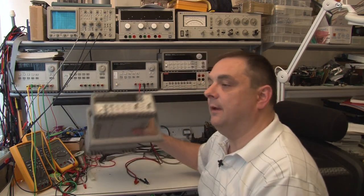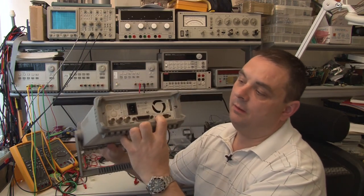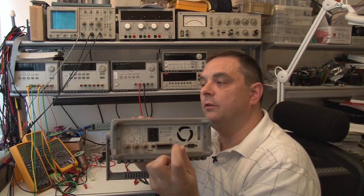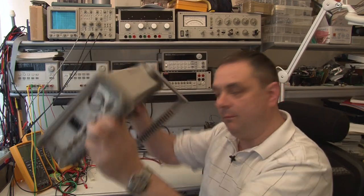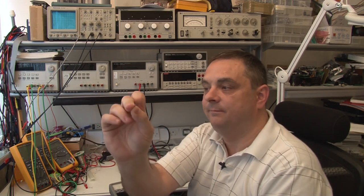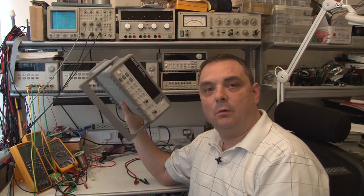In doing that, this is shipped with the standard oscillator that comes with the system by default. There's a little trimmer cap inside that you can trim. But in trying to trim it, the cap inside just broke up into a whole bunch of parts and ended up floating around. I think all the bits have fallen out now. So really disappointing — for something that cost over a thousand pounds new when it came out of HP, to have an oscillator that is so absolutely poor.